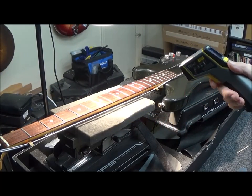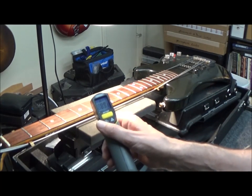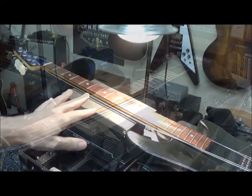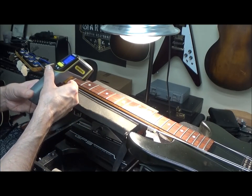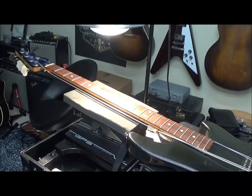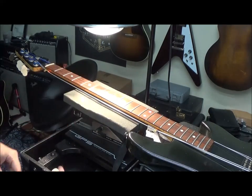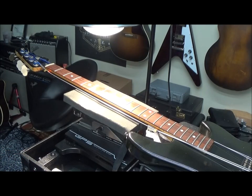Here's another view. I don't know if you can see my laser pointer, but this is how I test to see what temperature I'm getting up to. You might notice a little steam coming off the wood - that's okay, it's not going to catch fire or anything. I'm up to 155 degrees right here in this area. You can swivel the boom stand and concentrate the heat for a few minutes here, a few minutes there - a total of 20 minutes with sustained heat between about 140 and 160 degrees. I think once you get to 175, you're pushing the envelope.